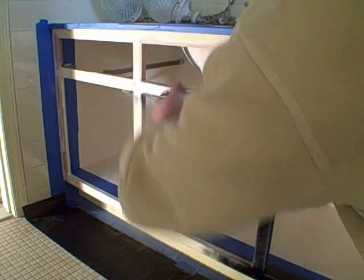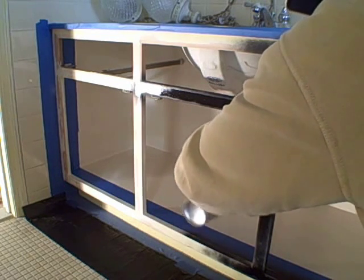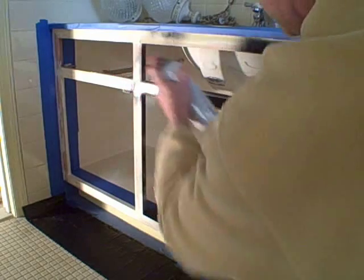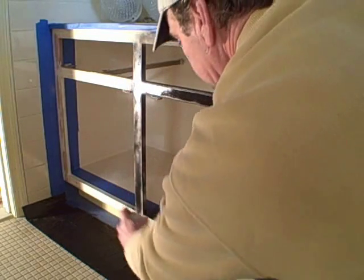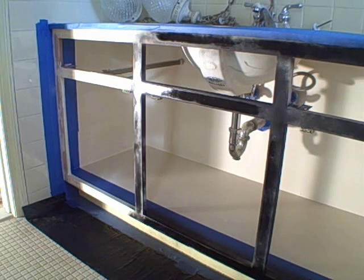Realize that you're going to have to put three or four coats of paint on, and don't try to completely cover the surface — just get a good amount on it. See how I'm doing this across the bottom edge, holding the can out and away a little bit so I don't get any on the beige paint inside. I'm barely covering it, which ensures I'm not getting too much paint on at any one time. Light thin coats, several of them, and then we'll apply some urethane when we're finished.